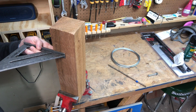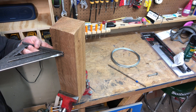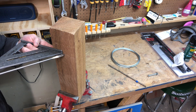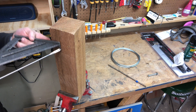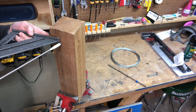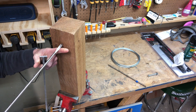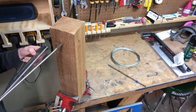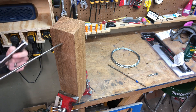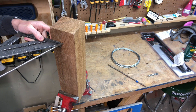I find the center of my post, put my drill like so, and then just use the speed square as a guide. You're not actually going to hold your bit against it because you'll run out of room, but just use the speed square as a visual guide. I'll kind of show you here — I'll start by eyeballing the center of this post, get a hole started just a little bit so my bit doesn't walk, and then use my speed square like so.